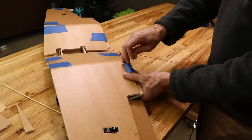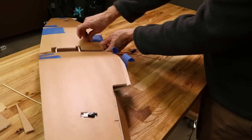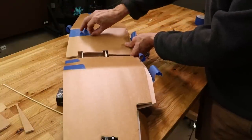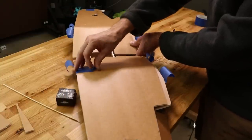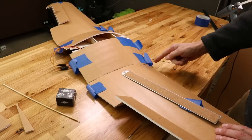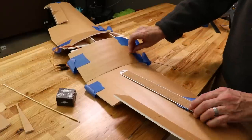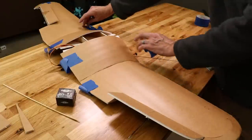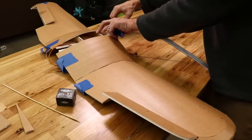and by now all of our glue has had time to cool. Now you're going to notice when I pull the tape off, I'm only pulling it halfway off. And the reason I do that is I don't want to take this piece of tape and tear it up and pull the paper with it. So I'm only going to go to the seam. So I'm going to do the same thing here on the top. Always pull your tape from the back towards the seam.